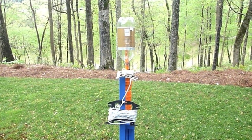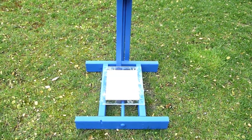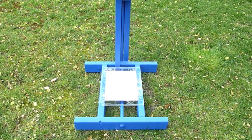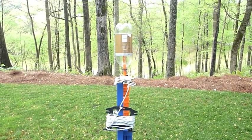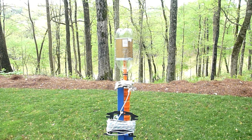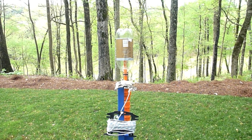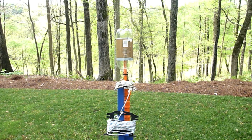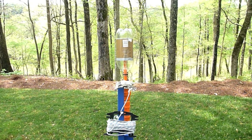The first thing we do with our unit is build it on a sturdy base. We use a lot of two-by-fours, so the half-inch PVC launch tube and air system runs basically through the middle — you can see it there in the base — and from there it runs up through the uprights and pops out above the trigger mechanism. The base is really heavy and maintains the system, so even when you're tugging to release the trigger or doing regular launches, the system doesn't fall over. It stays in place — a nice way to keep the system secure.